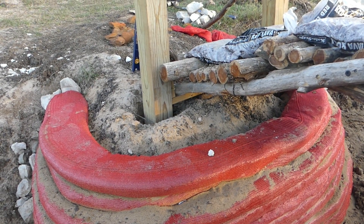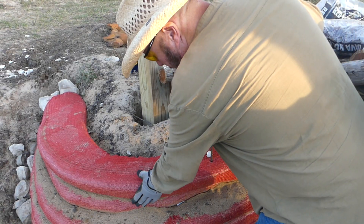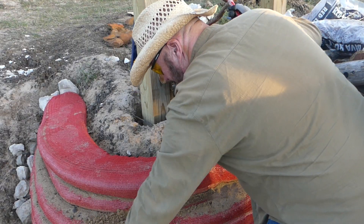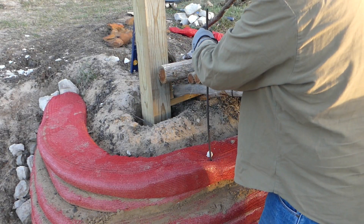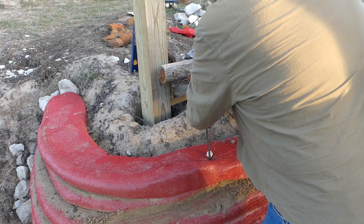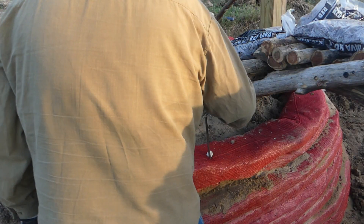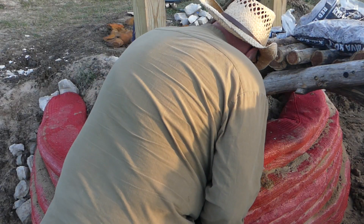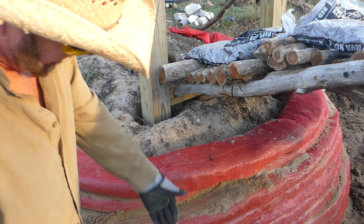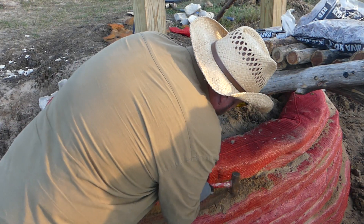One reason I'm doing it this way is because this is my idea for the side of the house. I'll be a little more careful when I tamp them — nice and flush against each other — and when I come in and stucco them, they'll look real good. I want to make sure I can feed rebar down through it. And yeah, I can — it's going right in. When I get to the top plate, I'll be able to pour a concrete top cap on top of the roof, and that will hold these bags in place. As I go up eight, ten rows, I'll run a four-foot piece of rebar down through it periodically. Do I think it needs it? Honestly, I don't think so.